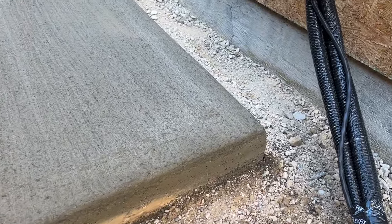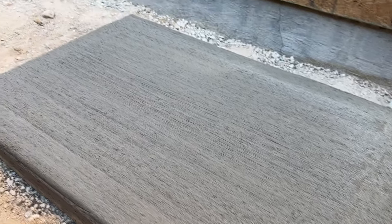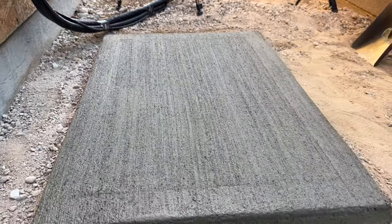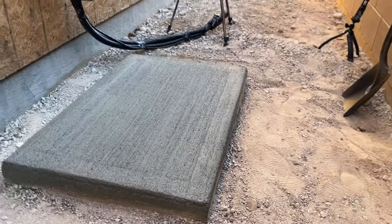After all that, that's pretty much it — really easy, and not that much money to pour your own little concrete pad. You can put rebar in it, you can finish it. I would recommend even just doing this for practice — grab a bag or two of concrete, eight to twelve bucks' worth, play with it. Get yourself a little corner edging tool, run some relief cracks, and practice. This is how they do it in the schools — they pour small areas and have students practice all the different finishes. If you want to try stamp concrete, invest in doing something small first so you can learn from your mistakes. Concrete is a technique you've got to learn — it's a craft — but it's fun to do it yourself. You can do walkways, stepping pads, even put your handprints in it next to the house for the family. Just play with it and see how it works.